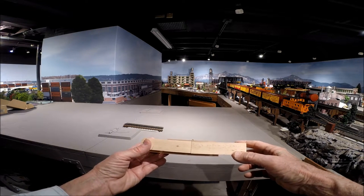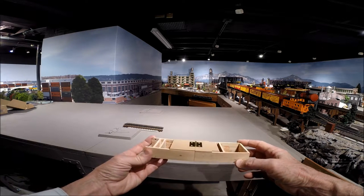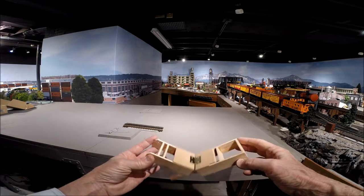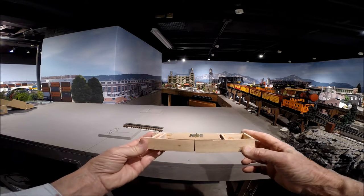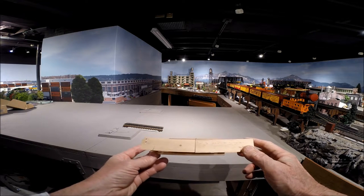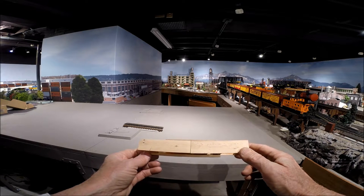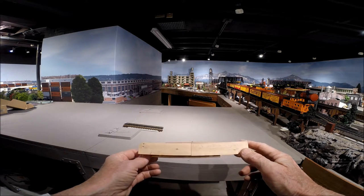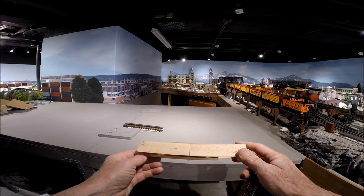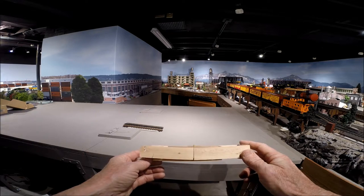Just picking it up and getting it into place to where I could line up the holes and drill the pilot holes for these screws was a chore. So I was thinking, well, I need to have some sort of counterweight or counterbalance system. I started out thinking I'd put some gas pneumatic plungers on here that would lift up the table if I hit a little foot treadle, and that became pretty complex and expensive, so I abandoned that.